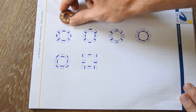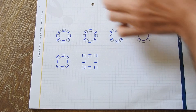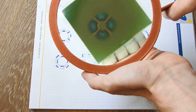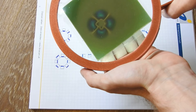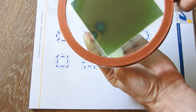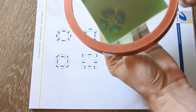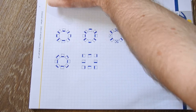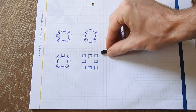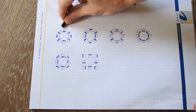Here the field is focused to the center in just a ring pattern, and here we have a north-south pole alternating arrangement. Down here we have a square-shaped Halbach array focusing the field to the center, and a Halbach array with 12 magnets equaling 6 poles that also focuses the field stronger on one side. Now that you have seen what they look like under the magnetic viewing film, I will start explaining how to arrange each array to get each field type. Let me start with this first array.